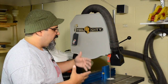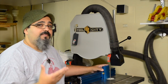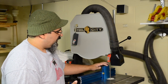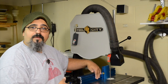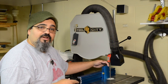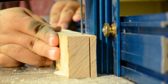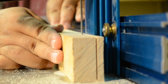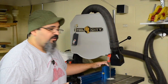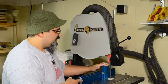As a tool for re-sawing, there are a couple of different ways to do it. My preferred technique recently — and probably for a long time to come — is using what's referred to as a single point jig. Unlike simply running against the fence, with the single point jig only one single point of the material is touching the fence, so you can control it as you make the cut. If you notice you're drifting a little bit to the right, you can compensate. And because it's only contacting at that one single point, it always stays right where I need it to be.